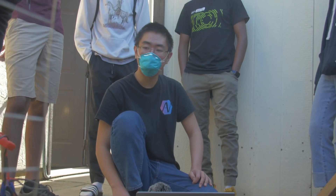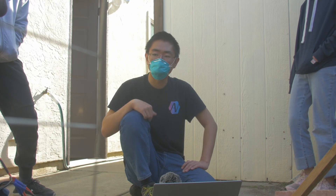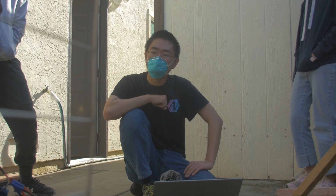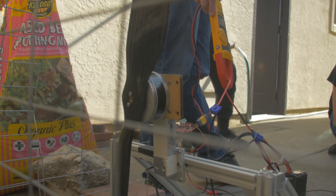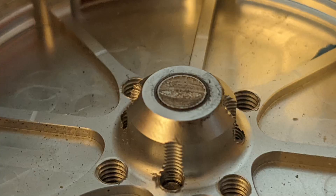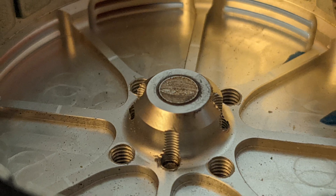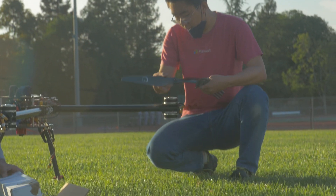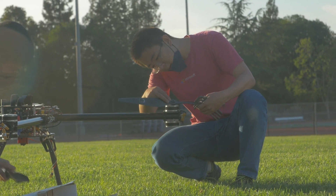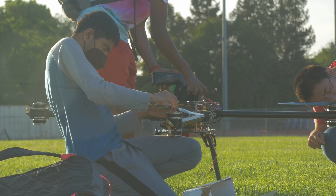We ramped the motor from zero to one thousand on the motor test stand. Through our testing in the field and on the stand, we discovered our first choice of motors was unreliable due to a critical motor shaft breakage issue caused by lateral forces induced by wind, presenting an unacceptable risk in production. As a team, we decided on alternative T-motor MN601S-170KV motors, which have performance characteristics nearly identical to our previous SOAR motors.